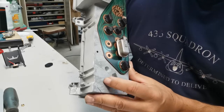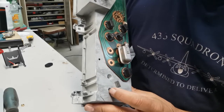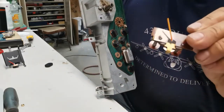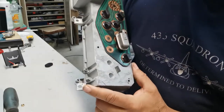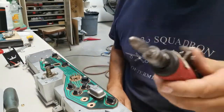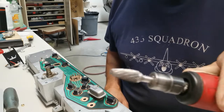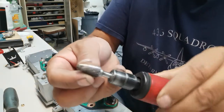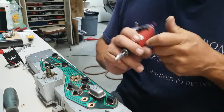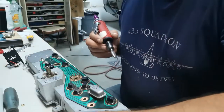If you've ever used a big drill bit, at the end it can get carried away — unless you put it in a drill press. Like you can see, when I was drilling out those little rivets on the old ammeter, it broke and got away because it catches and throws things around. So what I'm going to do is file them out with this little air file — it's got dual crosshatch slices on it, meant for metal, really takes metal off well. Safety glasses are a must — it throws metal pretty good.